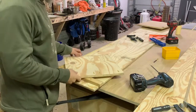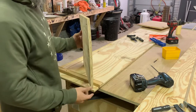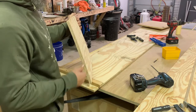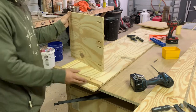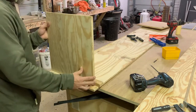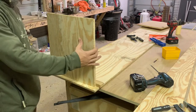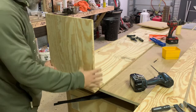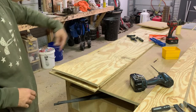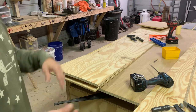I'm going to start putting it together. If you can see, there's almost a C-shape bow in here. In order to pull that bow out, I screwed this straight piece — I guess a cut-off two-by-four — on here, so I'll have something I can clamp to and pull the bow out when I shoot the pocket holes in. I think it'll work okay. I'll do both the ends, put my French cleat part in the back, and then move on from there.